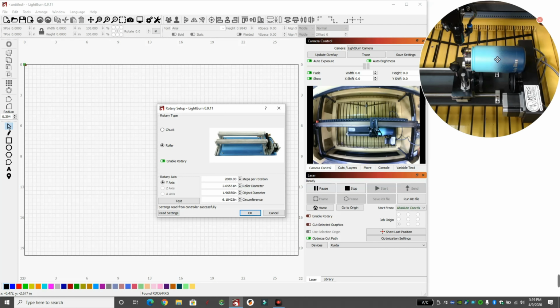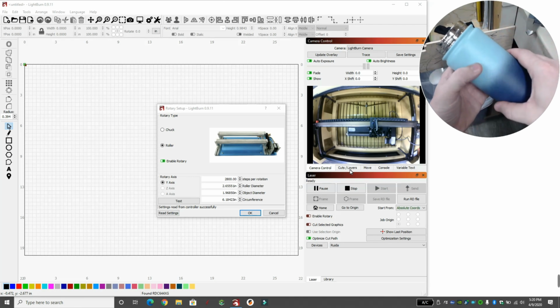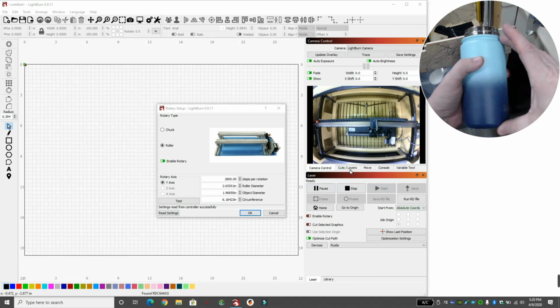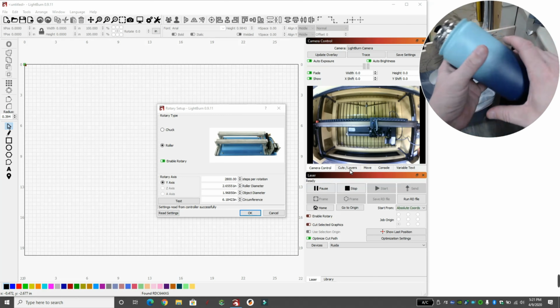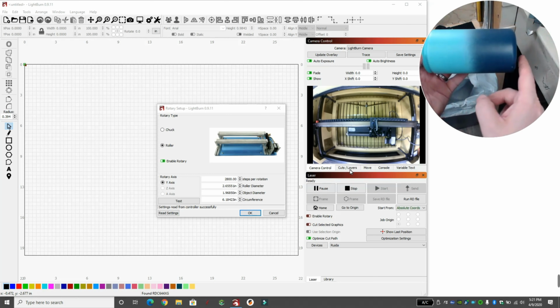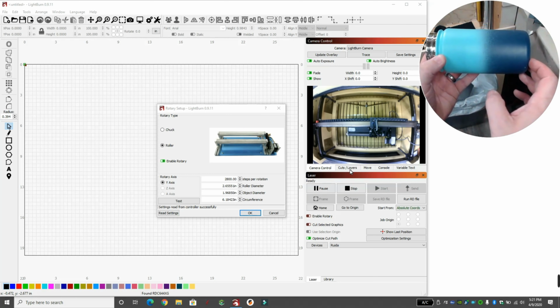So I'm going to get that out, and I'm going to get my digital caliper, or you can use a measuring tape. But I have a digital caliper, and if you don't have one, I highly recommend one. I'll put a link in the description below. This just gets you so much more exact than anything else. All right, so I have my can. This is what we're going to engrave. What I'm going to do at first is disregard this part up here because we can't engrave on any of this roundedness. So I'm going to start maybe at this point for my overall length.